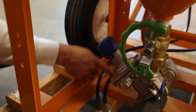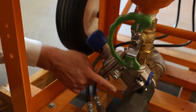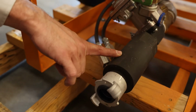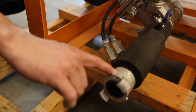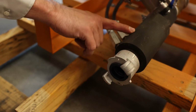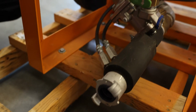So how does the injection block work? You have your main dry stack, dry abrasive in the blast pot coming down to the metering valve, and then after the metering valve, you inject water. So the MistBlast will be the innermost, so you have the most wear in the injection block, and the washdown will be the outer. So we inject water at a very high velocity, which mixes with the abrasive and airstream here that creates an optimal dust suppression at the nozzle.